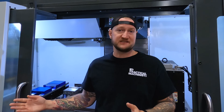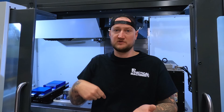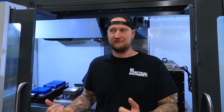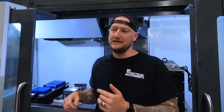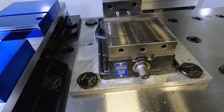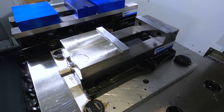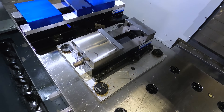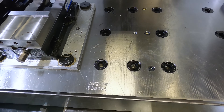That's been fantastic — we've been running parts on both sides of it. And even though we marred those jaws down, they're soft jaws, so we'll take an end mill, run it between the jaws in a closed position or with a parallel between them, and we'll have fresh faces and step jaws. Great system — I like that vise a lot. For the small milling vise, it's a heavy duty milling vise and I really like it. It does what it says on the tin. It's a premium vise — you can get a ton of force in it without worrying about bending the lead screw. We've done some really heavy milling in there, even holding on to about an eighth of an inch, and zero problems.